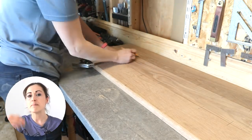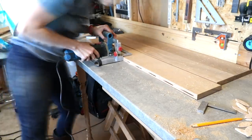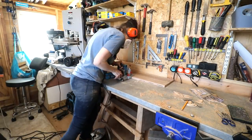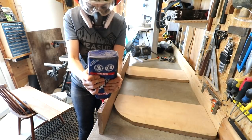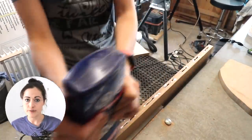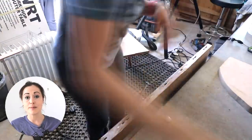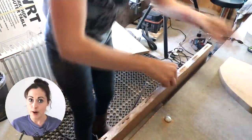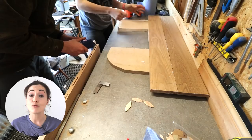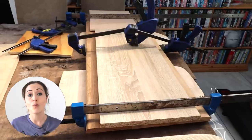You don't really have to do any measurements as long as the marks match, then cut the slots with the biscuit joiner. If you don't have one, you could use a dowel jig and hardwood dowels. When gluing biscuits in and clamping, a few key reminders: give yourself absolutely loads of time — more than you think you'll need. Do a bit of a dress rehearsal because you can never have enough clamps. Don't rush it, and use plenty of supports to keep the clamp straight so it doesn't bow while drying.